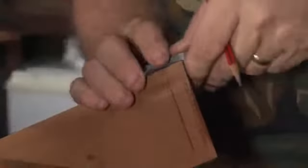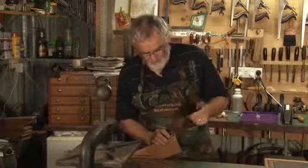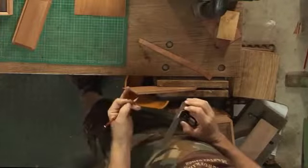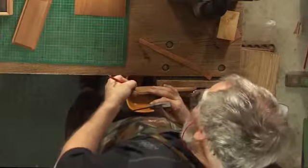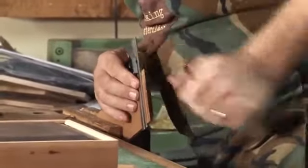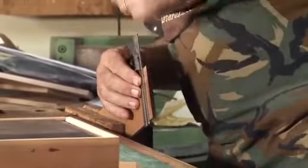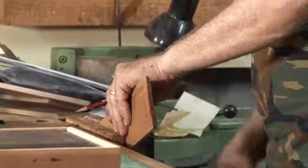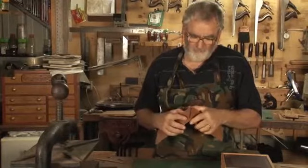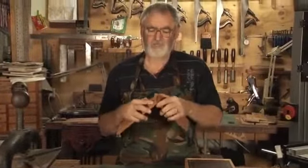And if you've got a combination square or a 45-degree square, just put it and draw a line there. So you've actually got a right angle there. Carry that mark over to the face, and then with the right angle side of your square, just mark a line. And if you do that to both sides, then I know how far I need to cut down when I'm cutting my wedges like that.